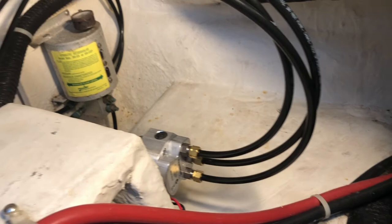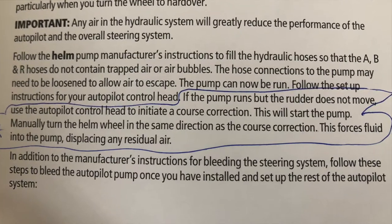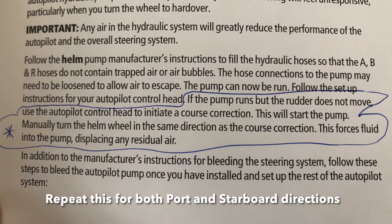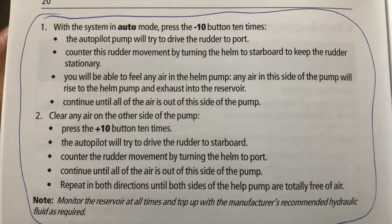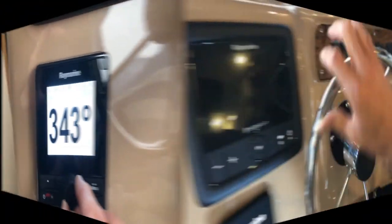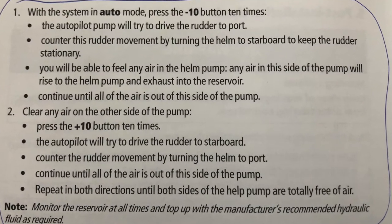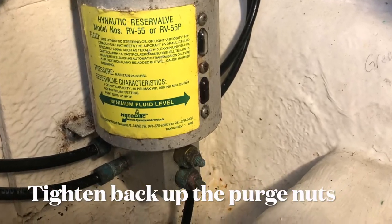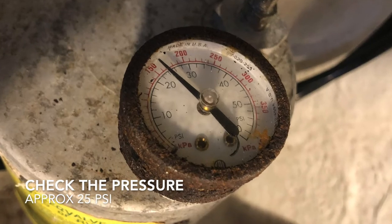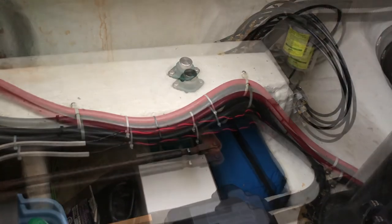It was hard to get the fluid to push into the pump just by turning the wheel. The way it's described in the Raymarine manual: while turning the wheel to starboard, you also engage the autopilot to starboard — that initiates fluid pumping through, and that seemed to work. There's also one last step where you tell the autopilot to go to port while you turn the wheel to starboard, so you fight it — that also pushes the air out. After another 60 turns each way up top, we don't seem to have any more air trapped in the system. The final step is to tighten back up the purge nuts on the reservoir, double-check that the pressure is still good, and then the steering of the rudders by both helms and the autopilot should be perfectly responsive.